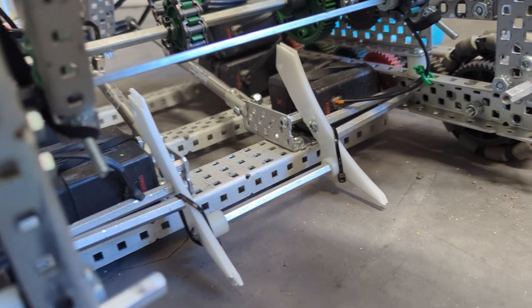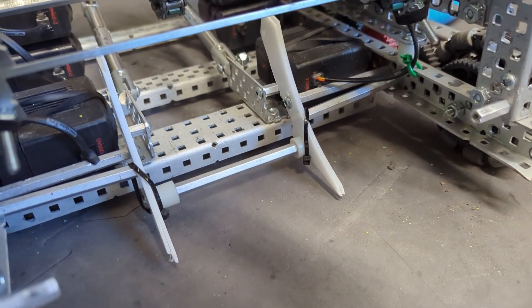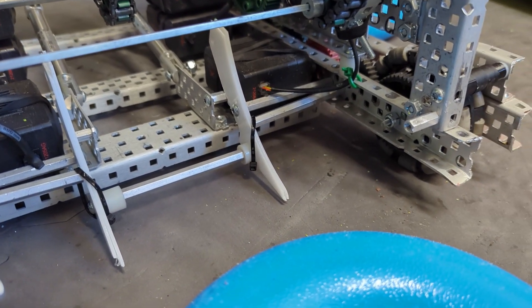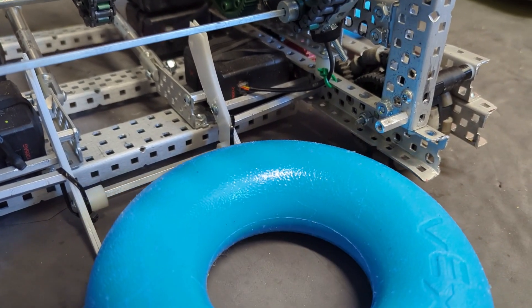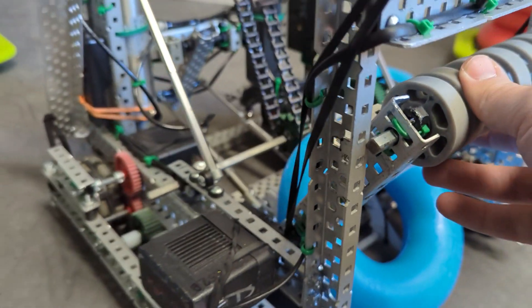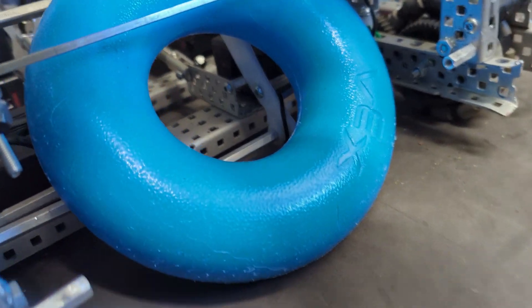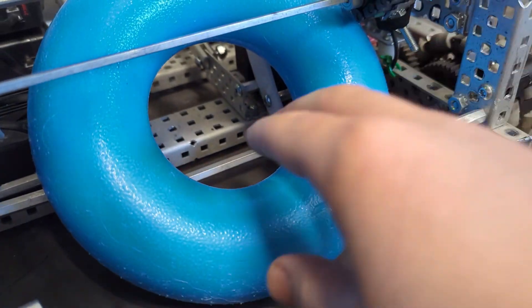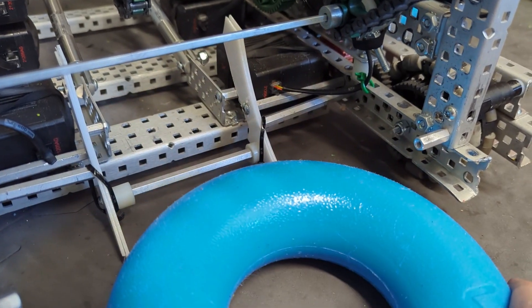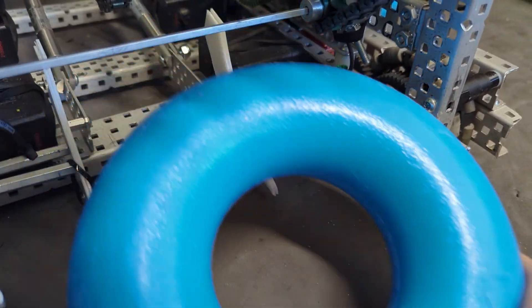But as you can see, these polycarbonate pieces are not just a flat piece like I had in my last video. These pieces actually work even better because they take the ring from a flat orientation and slowly guide it up into an angled orientation up onto that conveyor. The reason that this is better is because you're slowly changing the angle of the ring — it'll have an easier time going up than if you just suddenly had an angled piece and tried to push it up like that.